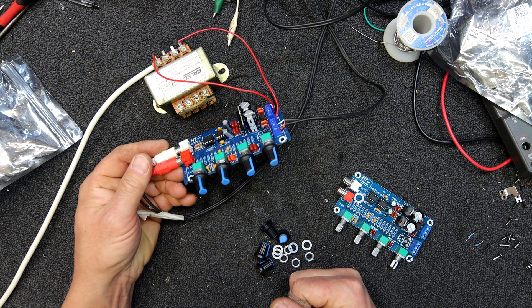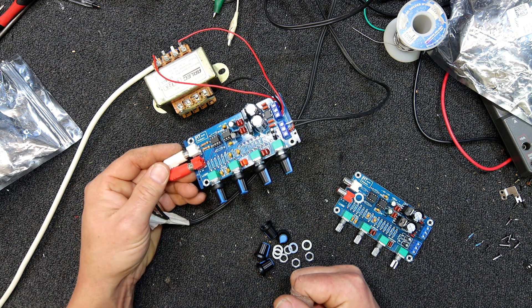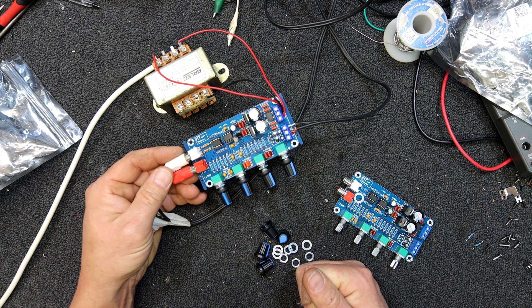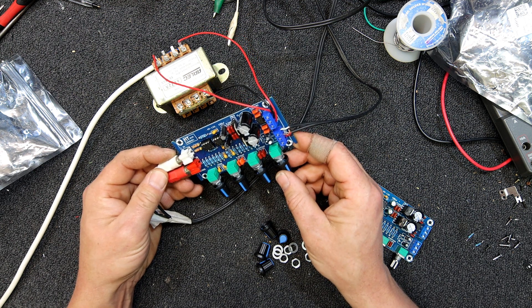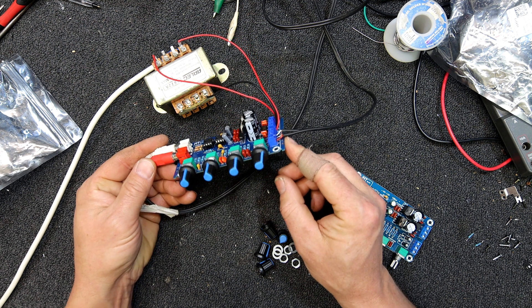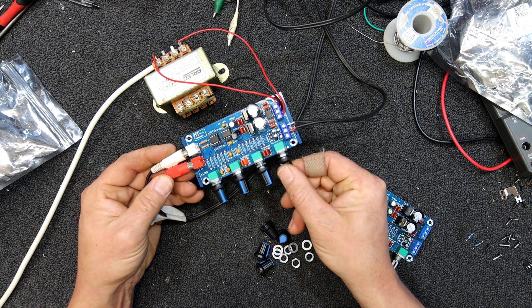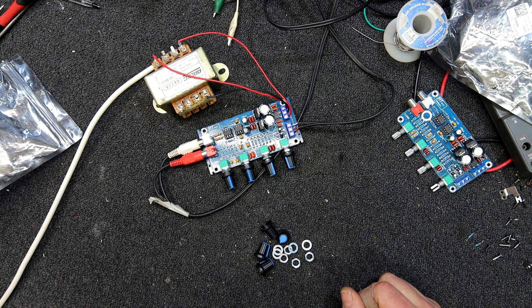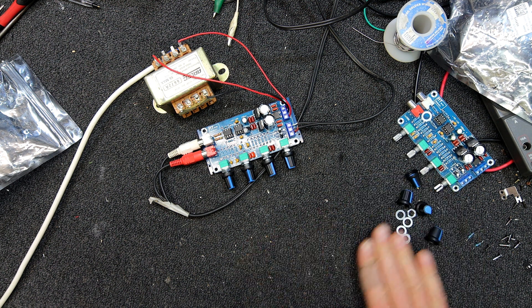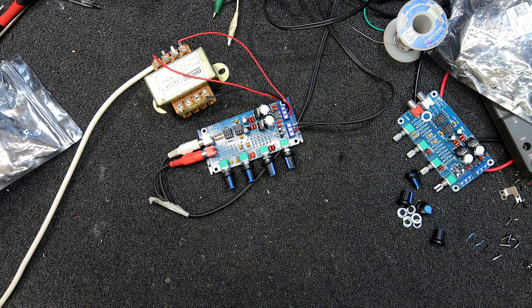The output could go off to an amplifier. I was thinking of just building it inside the amplifier with the pots sticking through so you can kind of preset everything. It's nice to have some tone control adjustment — I often like a little bit more treble and bass than flat, so music tends to sound a bit better with that. And you've got the volume control, which you really need on those block-type amplifiers so there's no chance of the signal going to full volume accidentally — you definitely don't want to risk putting out 100 watts by plugging the wrong input in.